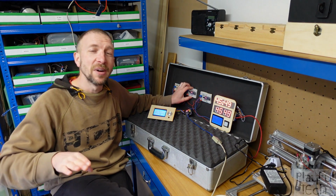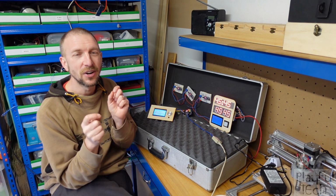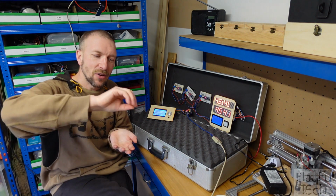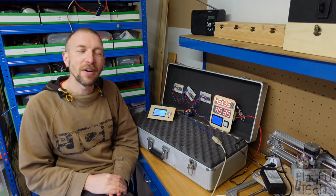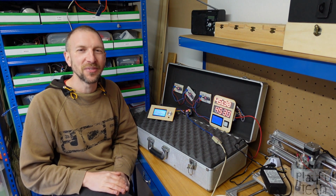But that's not what they meant. What they meant is, can I create a resistor divider between the 5 and the 3.3 volts and then use a diode to allow the current from the 3.3 up to the 5 not to go through the resistor? And that's a brilliant solution. So I'm very, very thankful. You know who you are who suggested that. That was a fantastic suggestion.